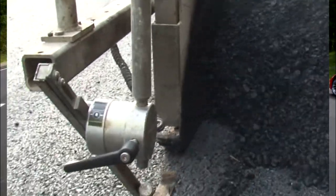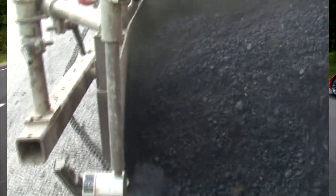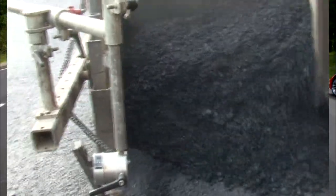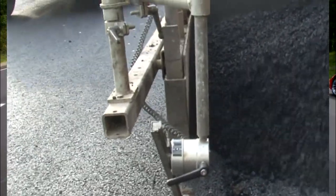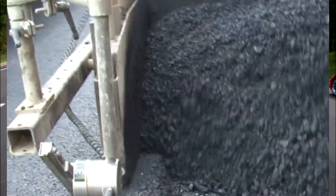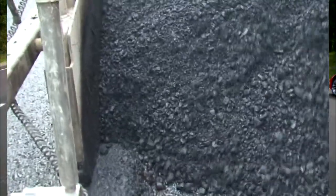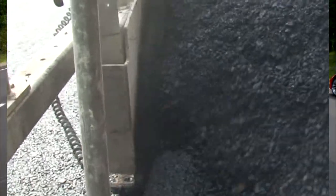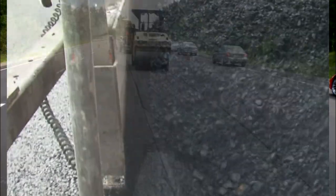The importance of well-maintained paving equipment cannot be overlooked. Worn augers may not convey the materials en masse to the end gate and can result in segregated material containing higher voids. It is also very important to keep the distance from the end gate to the augers no greater than 18 inches. If this occurs, segregated material may be supplied to the joint and make the first step of the construction process less likely to produce an acceptable longitudinal joint.